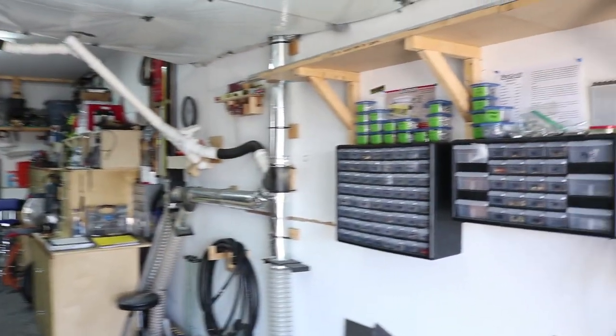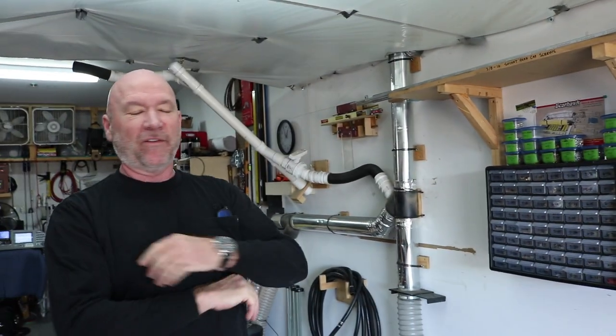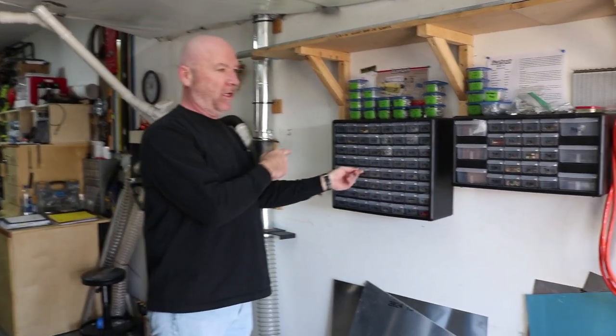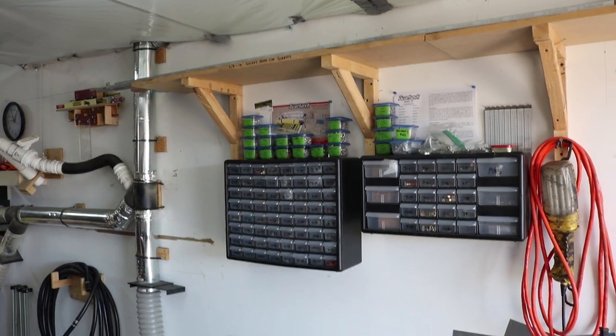This build uses a lot of aluminum squeeze solid rivets, and there are some pop rivets too — but the pop rivets are mostly on less structural things, just to keep things held in place. I've got all these AN fittings very well organized on the wall. If you don't organize them you'll just have bags laying around all over the place. It took me a day to do it, but now when I need a 414, here it is. It's a good investment to go ahead and organize it.